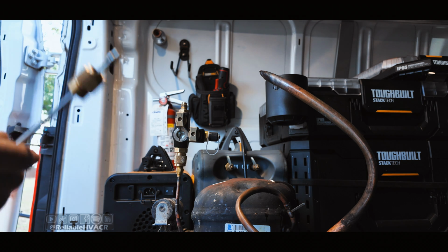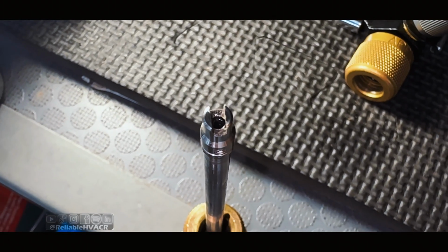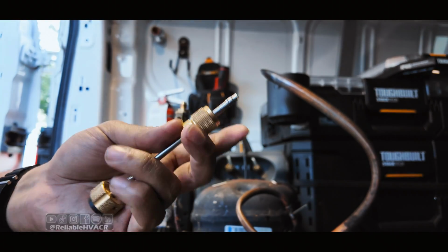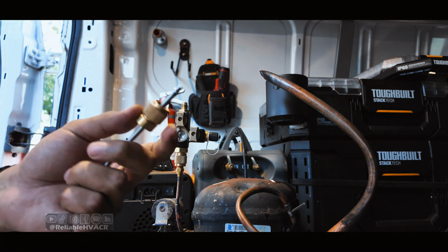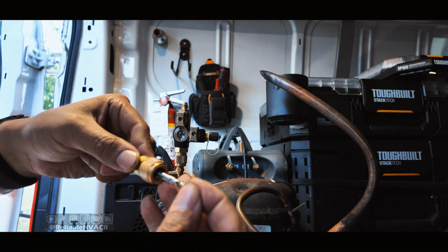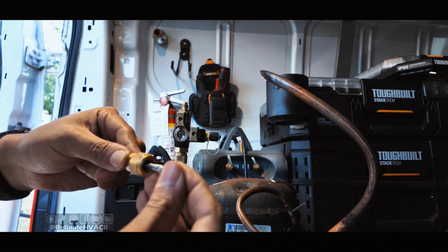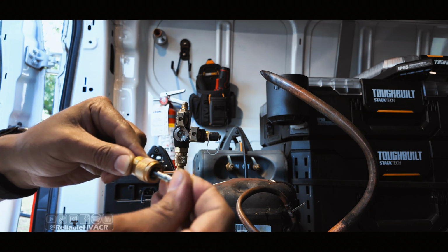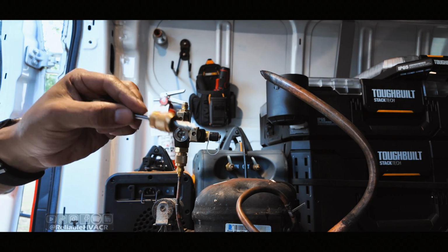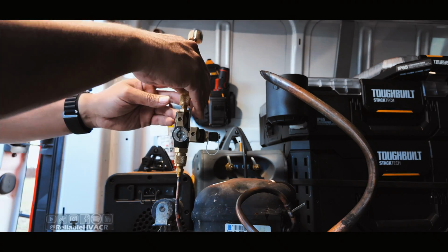This grabber, I think, is the one that catches the most, but you might struggle with it if you don't know how to use it. Curtis, the HVAC guy, and I talked about it, and he made a video on it. So just be wary, because the only reason I knew is because when I did my video on these, and I'll show it, I'm pretty sure I kind of trimmed it, when you put this on the actual puller, it's kind of hard to push on it. It won't grab it that easily. That's just because of the friction that it has. So I had to kind of wiggle it and get it in there, and then it's on there. So knowing that it took that much force for me to get that Schrader on there, I knew when I was doing this, I had to push down a little bit more. So let's just try this real quick.